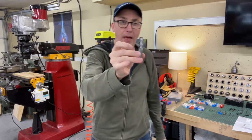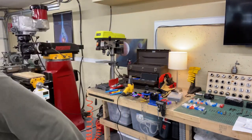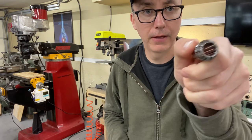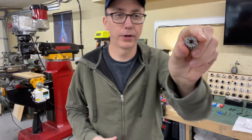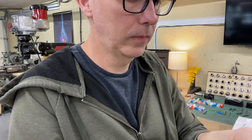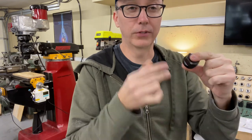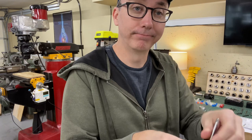Taking out a half inch end mill and going to put in my spot drill. Pulling out the half inch ER collet. And I've got a quarter inch ER collet. Fits in the cap. I once ordered one of these for my lathe and sent it back because the cap wasn't sitting flush, but I didn't realize you have to pop it in. But I learned.